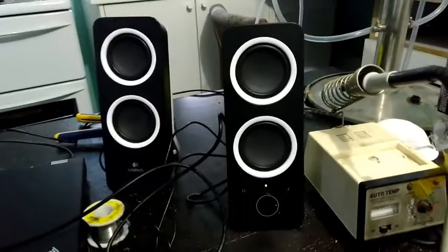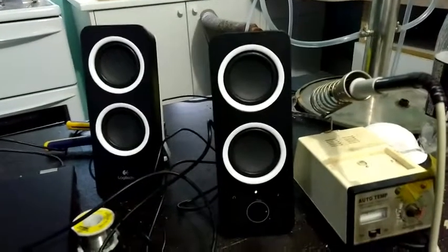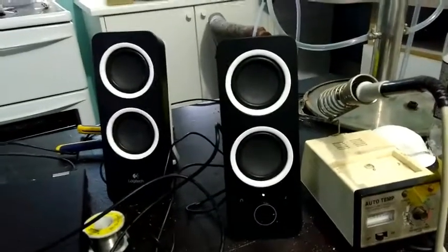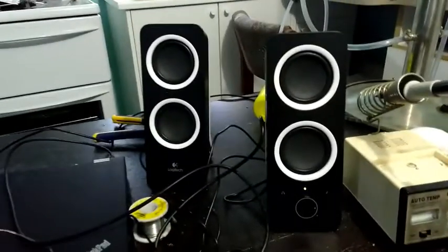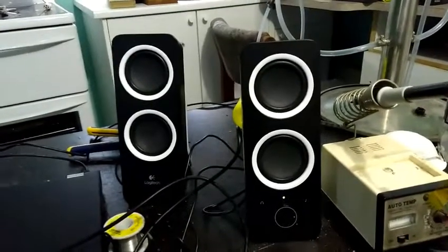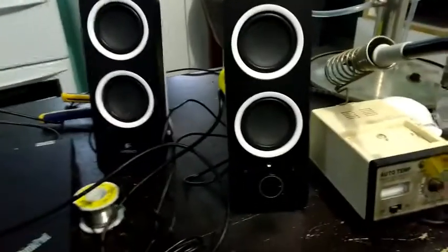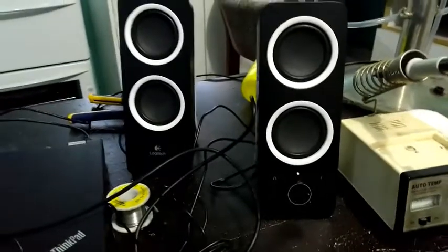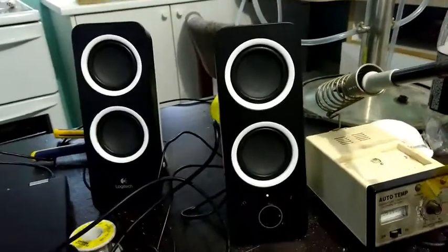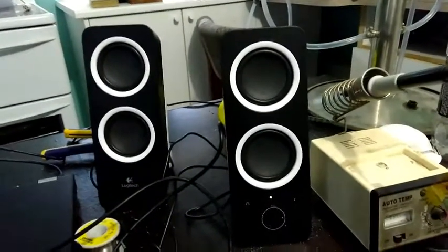This thing's running a class D module internally by the looks of it. So you're looking at about seven and a half watts total - about three to three and a half watts a channel peak driven. Not too bad. I've seen the chip before and used it in another project - they're quite nice, easy to drive, and handle these sorts of things well. No good as headphone amps though, because the two outputs have to remain independent because of the way they're driven. Otherwise, three watts a channel at five volt - no dramas. I reckon you could probably drive these a little bit harder, maybe up to six or seven volt, but you might be pushing the limits of that IC.